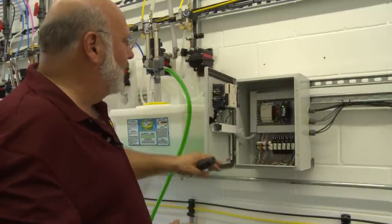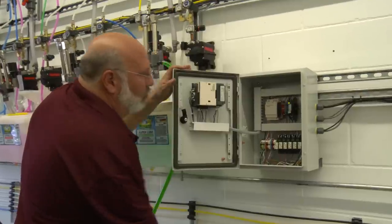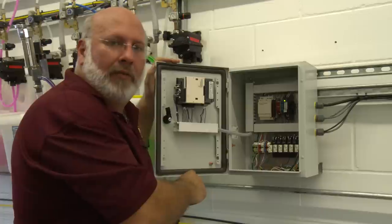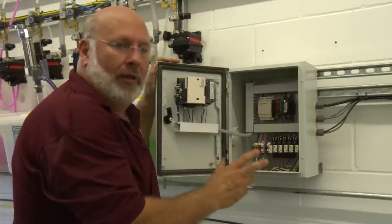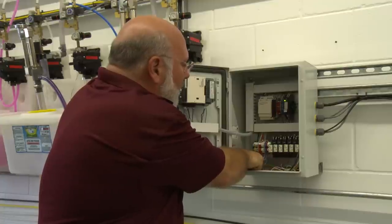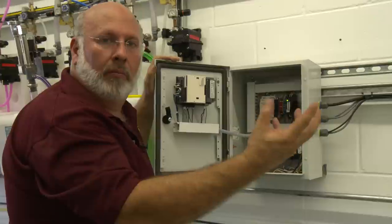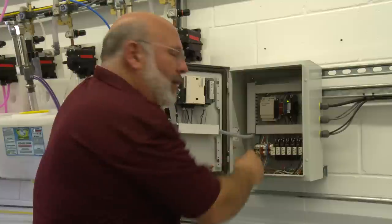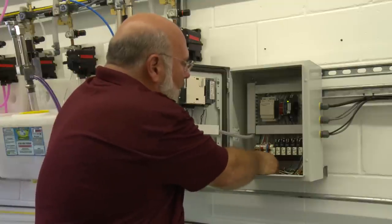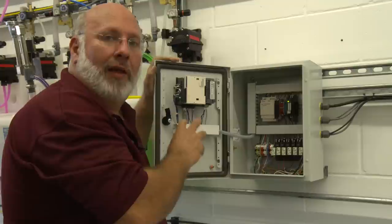It's a very clever program to make that work with one sonar sensor, and our engineers are fantastic at the factory. Inside, it comes pretty much ready to wire and needs a couple of connections. On the bottom left it gets its power — 110 volts, constant power from a supply within the equipment room. The orange section is our pulse switch coming from our computer, our controller. We also have a conveyor start signal from our controller, with our neutrals there as well. Then in this section we're wiring up our sonar sensor so we can get the profiling in here.